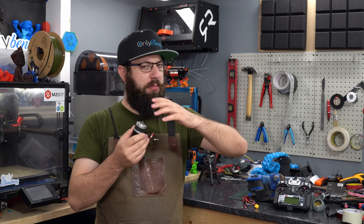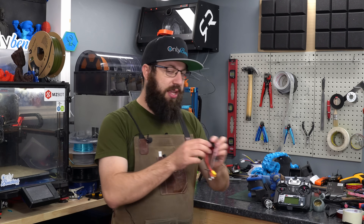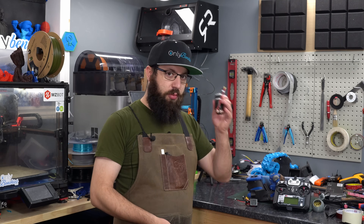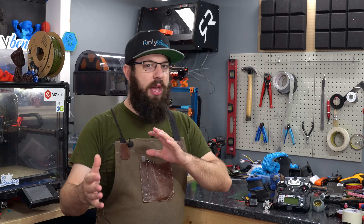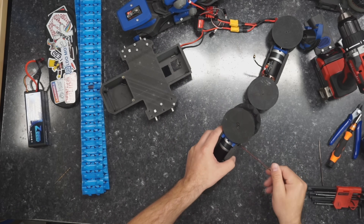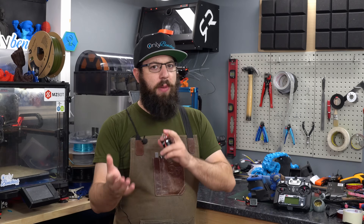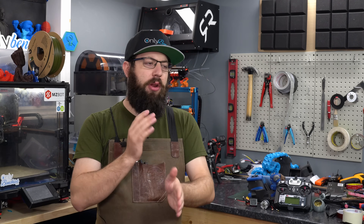I can't remember if that play was present before I put it together — that's something I didn't really look for. But functionally, these held up very well, along with the ESCs and the FlySky controller with receiver — all that functioned perfectly. I had no issues controlling the robot or its response. However, the printed parts that attach to the drive system — that's where we had the issues. Some of that I can chalk up to printing mostly in CF nylon. The parts seemed a little loose in fit when mounting within the bearings and engagement between the gears on the drive shaft and the drive gear for the tank tread, so there might have been some slippage and extra wear.